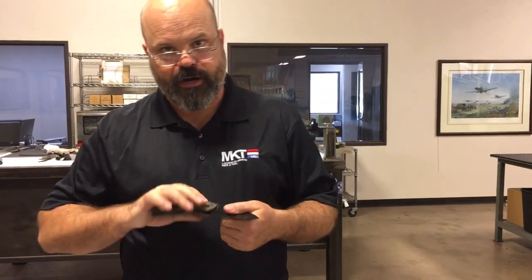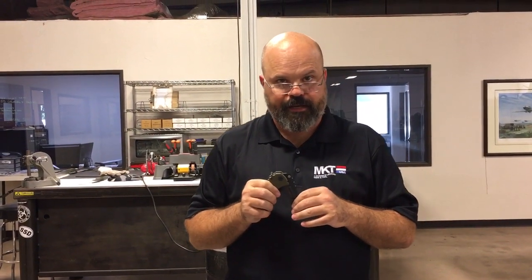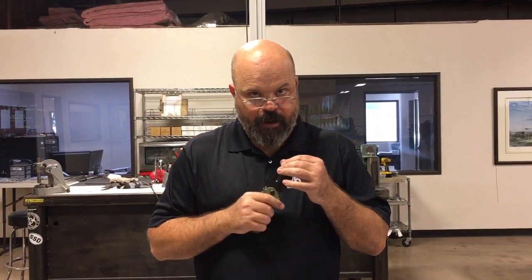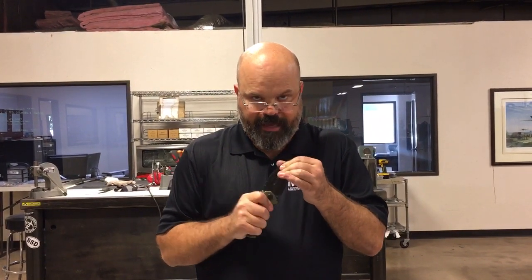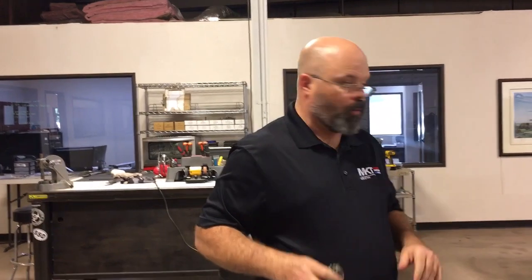Every knife, I open halfway, do a hard open. I like to see how it breaks. If it takes a little more juice to break it after a hard open, I'm okay with that. I open it a little bit, I feel for lash. I swing back and forth for pivot lash. I want to feel if there's any lock rock, any play in 3 axes at the end. Then I break it and I feel a little bit right here. If that's all good, then I want to do a one-hand open with the left hand, and I want to do a one-hand open with the right hand, or a right hand and then the left hand. And that way, I've kind of done everything that someone's going to do out in the real world.